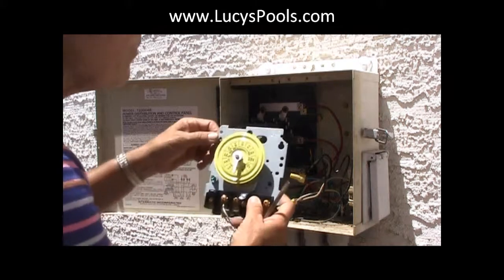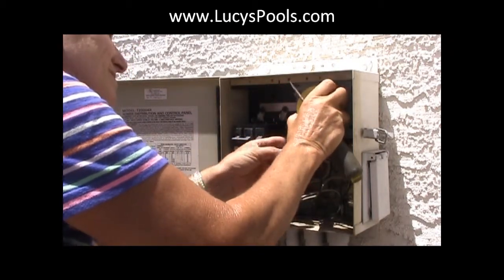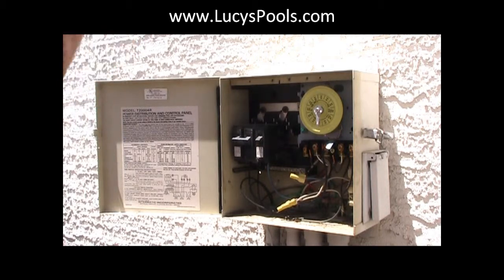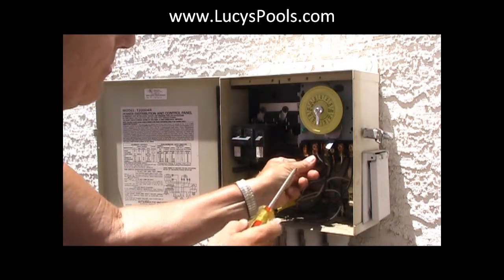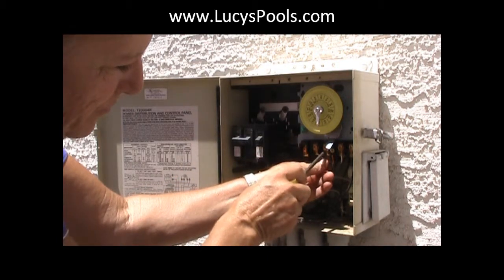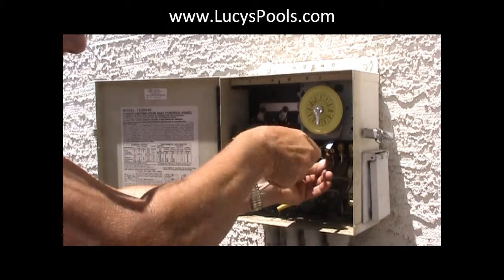Let's put this in. Now while I'm working with this, I'll put these in and then turn back to you when I start putting the wires in. I didn't have a magnetic screwdriver — it really helps. Now all we're going to do is just take the wires and put them up like that. Make sure they're tightened nice and strong. You always want to be careful not to put the plastic coating underneath, because then it's not going to be a tight fit for the metal. Just have a little metal poking out.